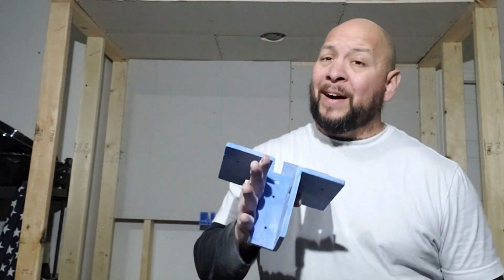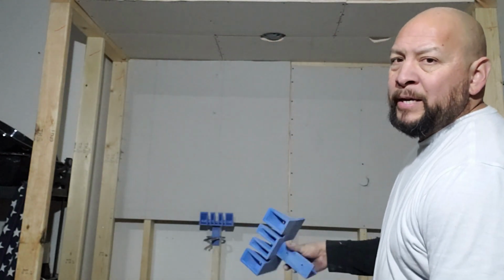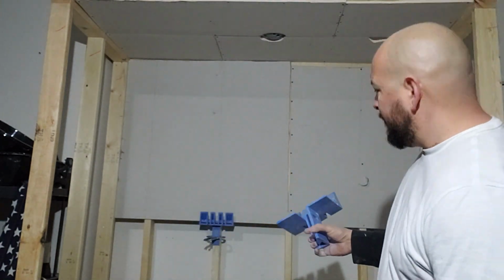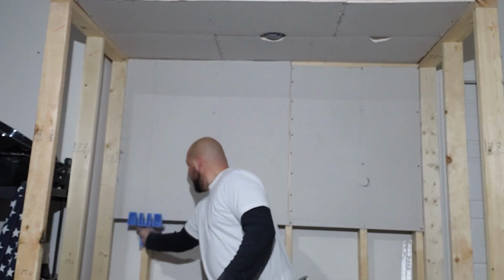I'll be honest, I've only used them a few times, but I just want to throw this out there. If I can find the link, I will put it below, because I love self-employed people. I love people who are inventive, and this guy came up with a great idea. So what it is, you can see back here, these are holding the drywall. If you're hanging drywall by yourself, and I forgot because these are small panels, but I'm acting like these are big panels, and you have an 8-foot sheet or whatever, it comes in a set of 2. And all you gotta do is set this on the stud.